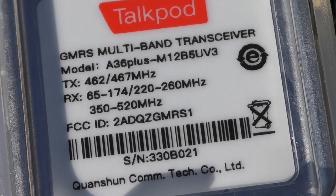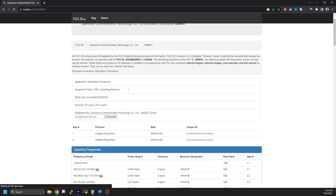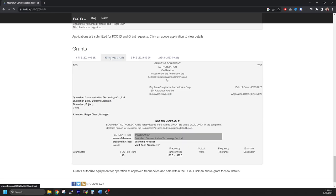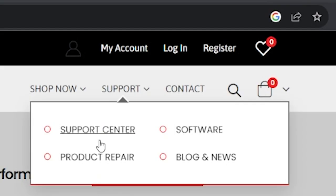Some may even have issues with poor spurious emission output and spectral purity. It pays to do proper research. If you're concerned about a particular radio, you can find the FCC ID before you purchase and look it up on the fccid.io website — a free resource where you can view all tests done on FCC-registered devices. This is especially useful when searching for radios like this Talkpod here, to check for GMRS or Part 95E certification. Some models might come from any number of factories or sellers, and long-term firmware support can be lacklustre or may not exist at all.